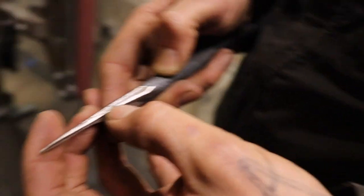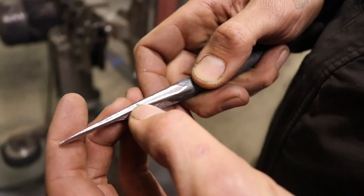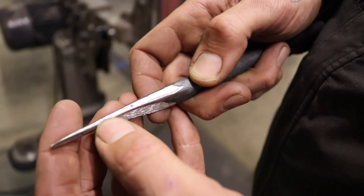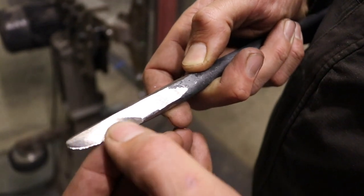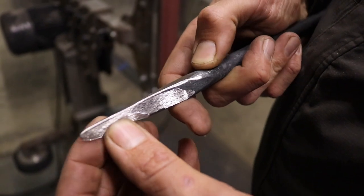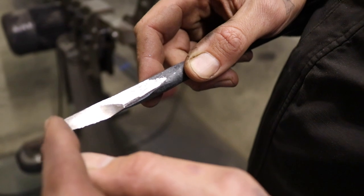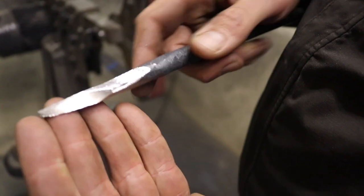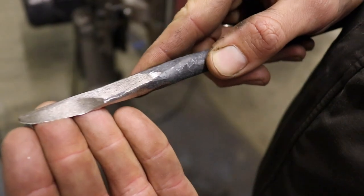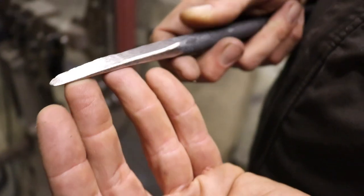Exactly. So an important thing to mention is when you start grinding, of course you will have all the shiny parts, but there are also those black parts you want to remove. You don't want any of these in your cutting edge because that could mess up your bevel in the end, in the form of an uneven cutting edge, and you don't want that at all when you turn, because that could leave marks in your finished product. Yeah, so that's worth mentioning.